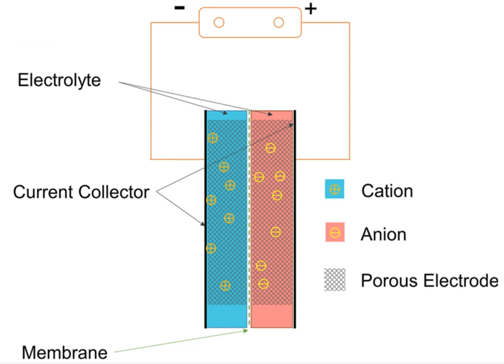Competition started only years later. In 1987 Elna Dynacap S entered the market. First-generation EDLCs had relatively high internal resistance that limited the discharge current. They were used for low-current applications such as powering SRAM chips or for data backup. At the end of the 1980s, improved electrode materials increased capacitance values. At the same time, the development of electrolytes with better conductivity lowered the equivalent series resistance (ESR), increasing charge-discharge currents.